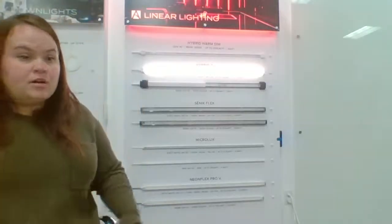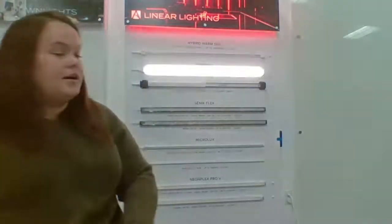So with that, you would just get us how long of a luminaire you'd like, and if you'd like a plug feed or a bare lead feed, depending on if you want to plug it in or hardwire it, and we will just make it here for you. We do a nice UV cure process to make sure that it stays IP65 rated, so if you want to install it outdoors or in a wet location, you can do just that.